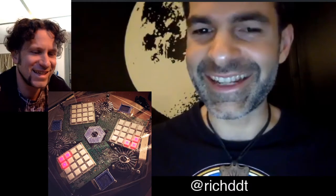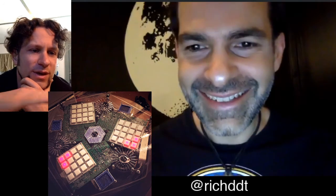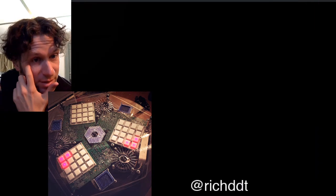Through the Tech Museum process they learned a lot about making installations sustainable long-term — reliable startup routines so you can just pull the plug and plug them back in and have them auto-boot and launch all the appropriate scenes. They also learned to make things robust in the physical world, for example when someone pours soda into it. One of the Mini Masher pads went down from the stickiness and required a deep clean. That's the double-edged sword of the horizontal interface — it's like nowhere to put your drink. That's why a lot of designs have been more pyramid-shaped, though pyramids are harder to build.